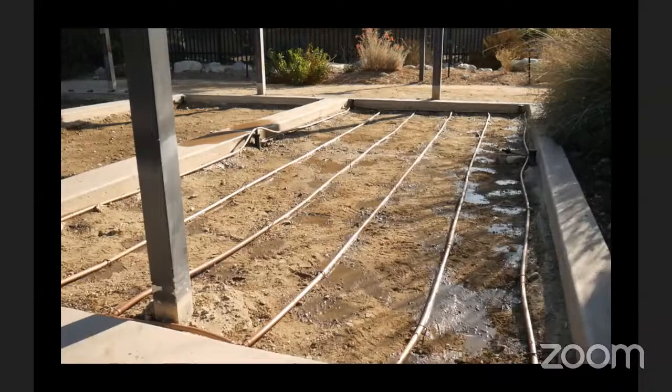You know, that's going to depend on the dynamics of your water pressure. All I know is, even with pressure regulation, like in my yard, and also if you're having to go uphill, things like that. In my yard, my sprinklers are just slightly uphill of where my valve is. And I have some that have 2 feet of pipe plus 18 inches of sprinkler body, and then another foot of sprinkler when it's going, and they run absolutely just fine. I have seen people in orchard situations, which is not what I would recommend, that have 5 feet of pipe and then literally something that makes it rain, and they work. But it depends, and I've not had a problem with getting them up within the range of what I am showing.